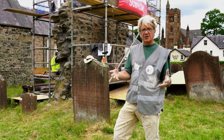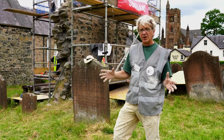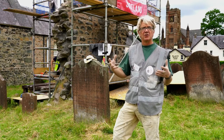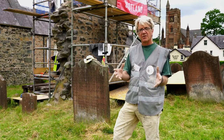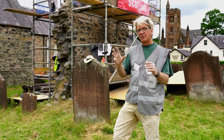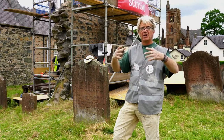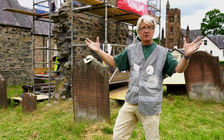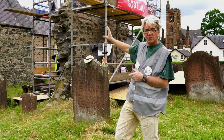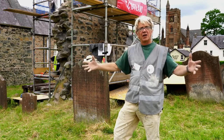But clearly the cement with which it had been done, with the best of intention in the past by somebody, is not doing that monument any favour. It's very wet inside, and the cement itself, because it is a very hydraulic material, shrinks and expands whenever it gets wet, and therefore it comes loose and cracks and lets the water in. And because it's cement, it finds it very difficult to get out again. We're confident here that any water that gets into that fabric, because we've now got a very breathable mortar, will come out again very quickly.